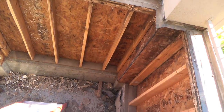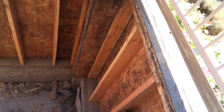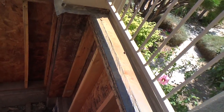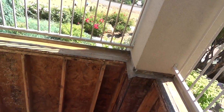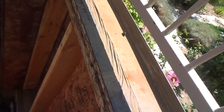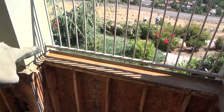And so when I was taking that plywood out, now do you see why the plywood only came out to a certain bit? Because apparently they decided to make the height of the walls the height of where they were going to put the flashing. So I'm going to cut that top black stuff flush with that. I'm going to look underneath there. Is there plywood that's under there or not? And I'm going to clean off that edge a little bit better.